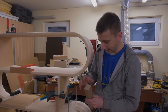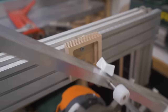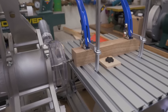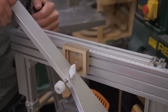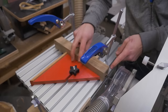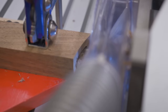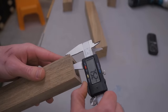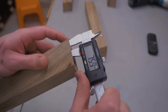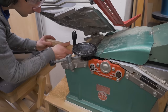And now, with all of them done, I can cut their joinery. To cut the joinery, I again set up on the Pantorouter, this time using the inner part of the template that I used before. And now I will cut a centered mortise into all support pieces. Quite important: to cut the mortise on the other side, I rotate the piece, but with the same side on the table. Doing that ensures that this side thickness is the same on both mortises, and that's important because later that will align the whole shelf. Next, I grabbed some random scrap pieces of hardwood and made them into floating tenons.